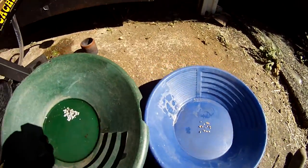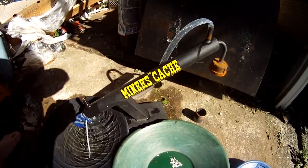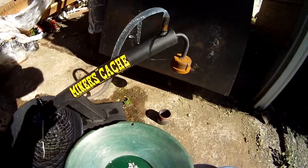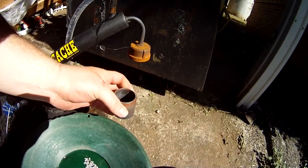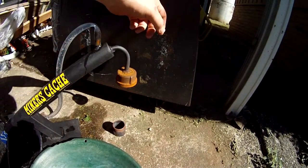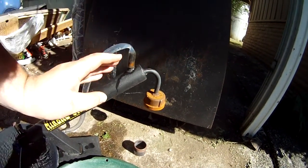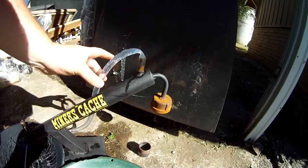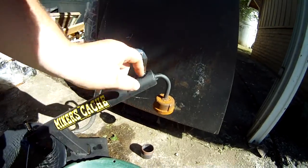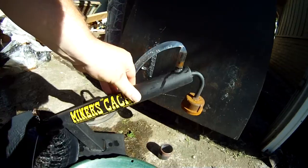The retort I'm talking about is this one right here from the Miner's Cache. This little puppy runs $225 — it is a 100% recovery system and it worked great. What you do is you put your mercury in here in small amounts, thread it in here, cinch it down tight, and you're going to heat it low and slow. That vaporizes the mercury, which comes up into this tube and goes into this double-jacketed cylinder. The outer jacket where the water is flowing through does not touch the mercury.